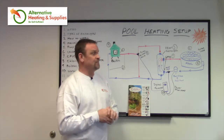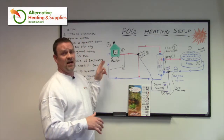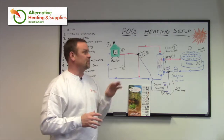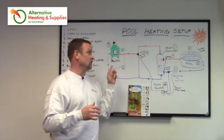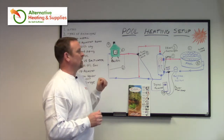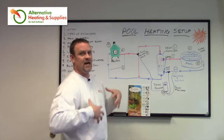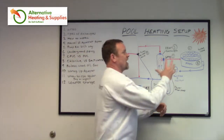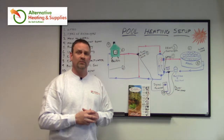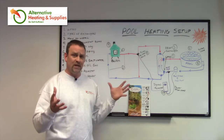That's the trick. Once you've got the pool up to temperature, maintaining it uses much less wood, and maintaining the temperature of the pool is much easier for loading the stove. The first couple of days, you'll be burning a lot of wood, oil, or whatever heating system you're using, because you've got to heat that many gallons of water and also heat up the ground around it. So don't be surprised that you'll go through some oil, wood, natural gas, or propane — just like a conventional pool heater.